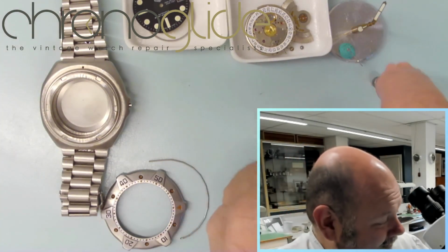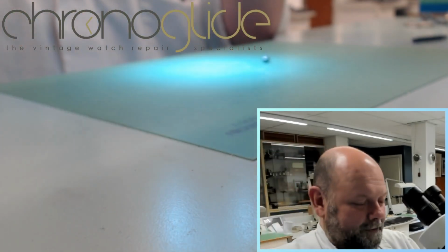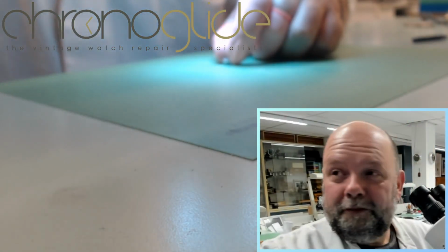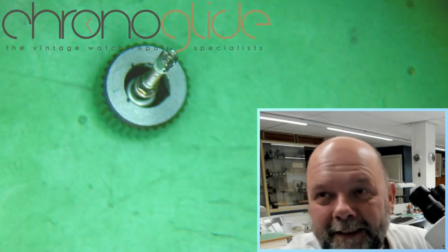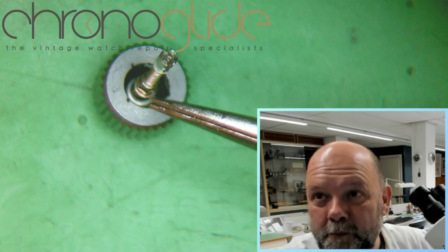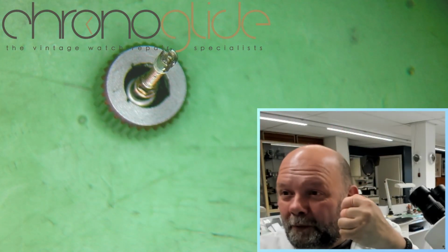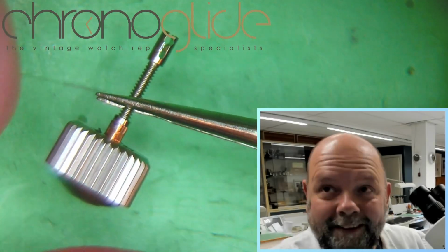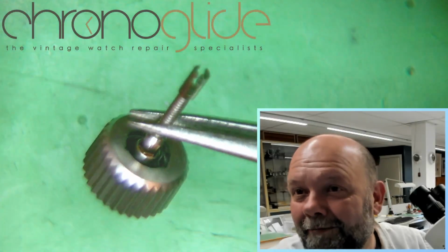But you can see the rust on the inside. Well, I'll show you under the microscope what happened to this one. Because if it's waterproof, you might expect a waterproofing. Here you can see it is a winding stem, but in two pieces, because the movement has come from the front, so you cannot remove the winding stem. So it is in two pieces like that, and it clicks on the other side.